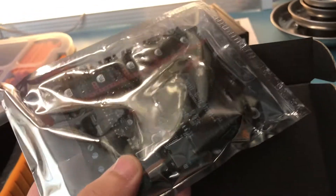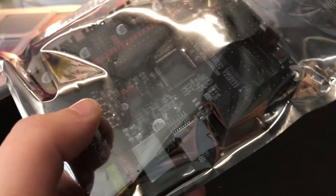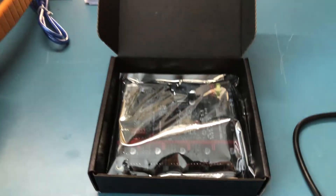Here is the 32-bit processor on this board. It's obviously not as powerful as the Duet's processor but it's good enough for the job, especially considering that these are basically slave boards. The Raspberry Pi is doing the actual controlling using Klipper firmware. The Raspberry Pi 4 is what I'm planning to use, but it's not ready yet — I'll show you that when it is.